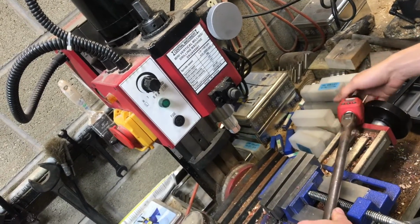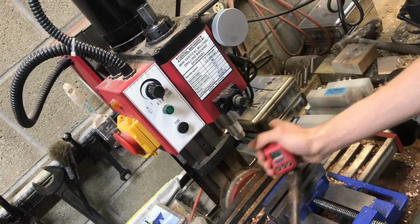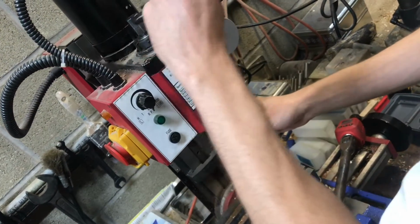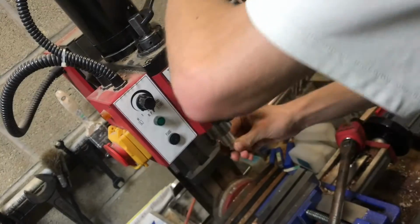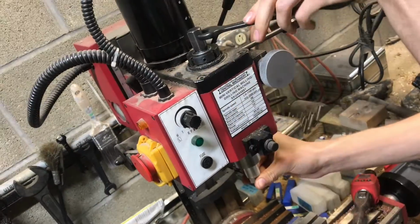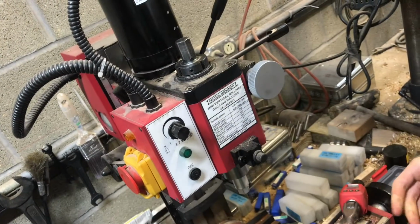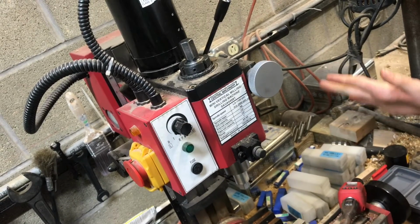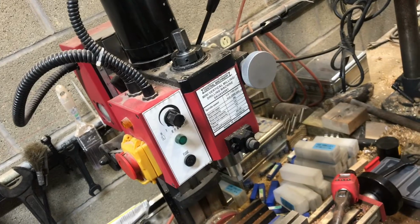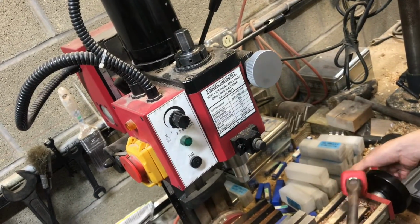Oh, the other thing is, whenever you do multiple trials, if you just keep doing this, you're always going to get the same number, so there's really no purpose in doing that unless you take the workpiece out and rotate it a little bit. That would probably be even more important if you were testing a serrated collet, because your workpiece could develop little indents where the serrations are, and you would skew your numbers if you continually dug deeper into your workpiece.